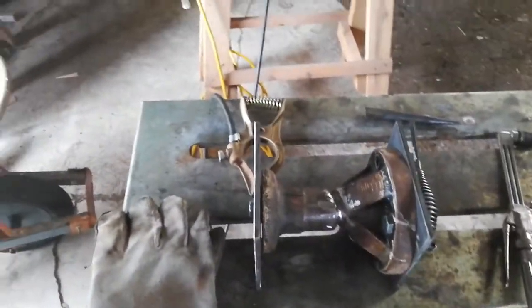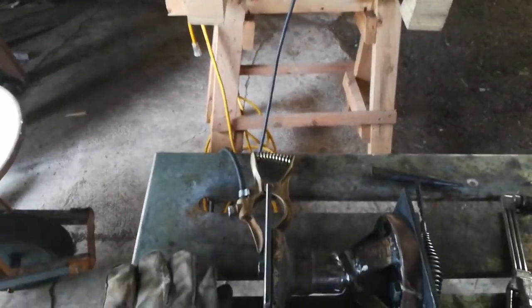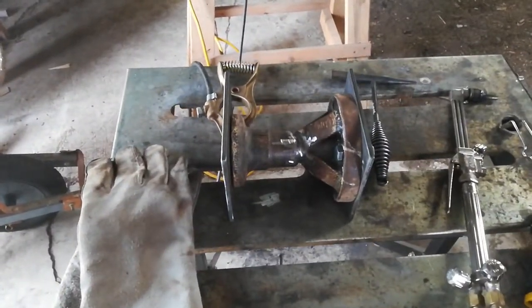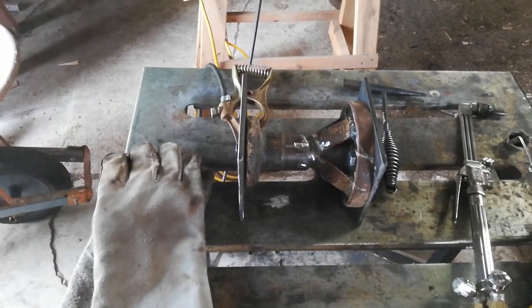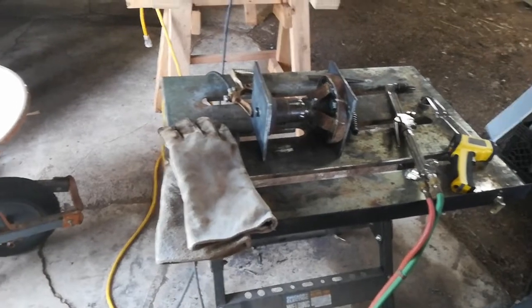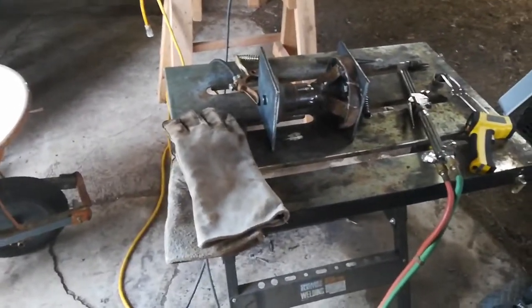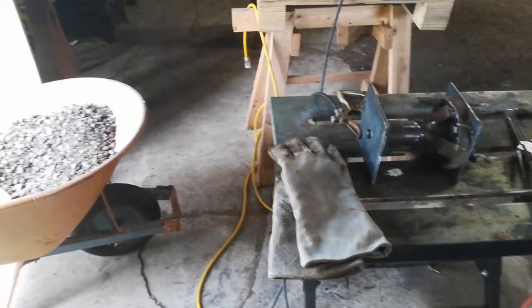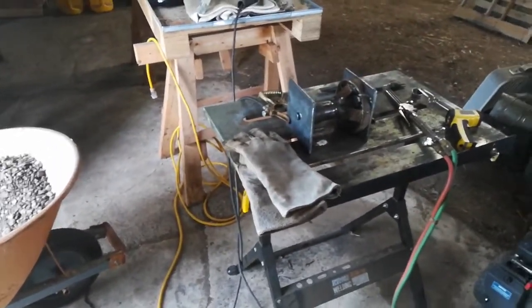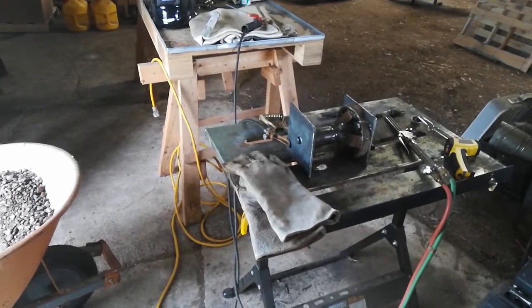Then I'll come back and repeat the process until I have a root pass all the way around. I'll use up all this welding rod and then top it off with a 7018 if it doesn't fill in. It's quite a bit of work but it's really an experiment just to see if I can repair it. If it doesn't work it'll just crack and fall off and I'll have to go buy a part. Anyway, that's the plan — stay tuned, this will be part one. Thanks for watching, bye.